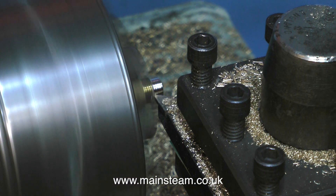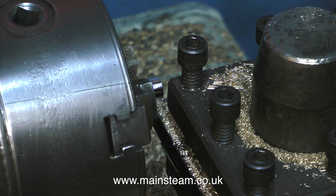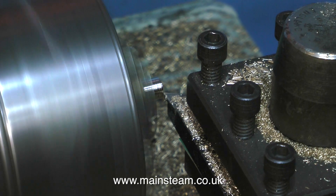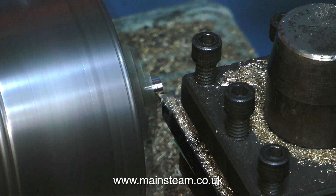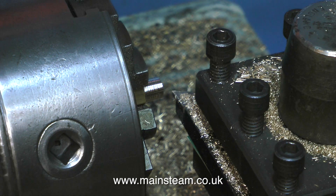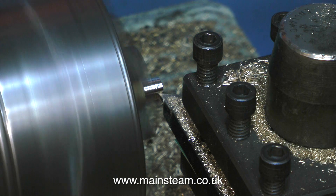So it's over now to the smaller of my two lathes — my little Boxford. The safety valve is held in the three jaw chuck by the hexagonal part, because I'm going to be threading this part using a die held in a tailstock die holder. It's better to hold the part by the hexagon because the shape will stop the part rotating when the thread is being cut.